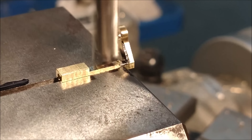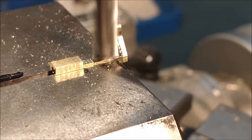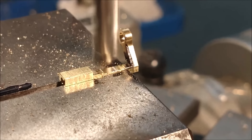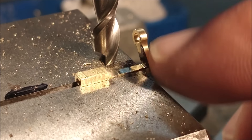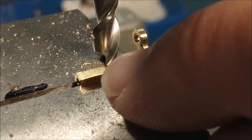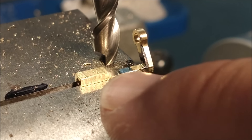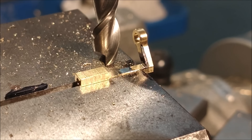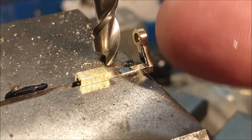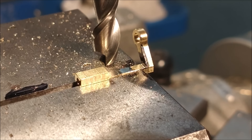The addition of a little Sharpie ink down in the corner you want to blend is a really good way to see the surfaces as they come together. Be very gentle with elevating the table at this time so as not to create a burr or an edge you do not want. The milling portion of this job is complete. The longer the bottom surface of this T-nut runs back to that angled link, the less chance you have of deflection. I'm going to deburr this, get some of the black off it, flip it over, and put the set screw in.